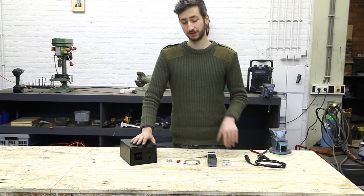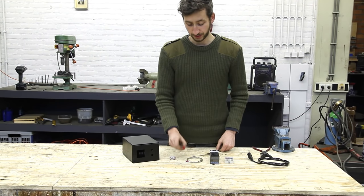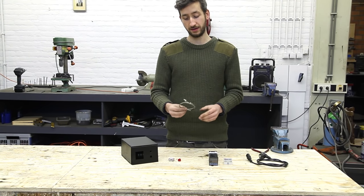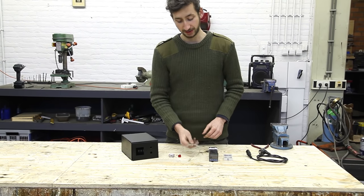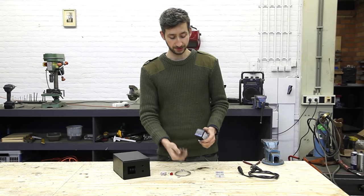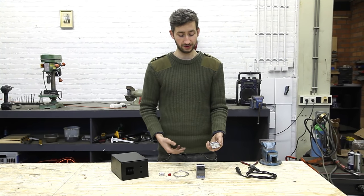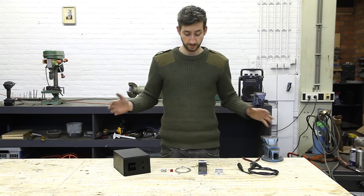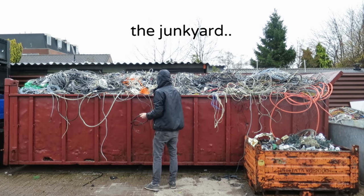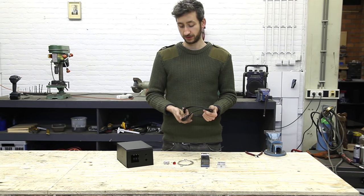We finished the metal box. Now we're going to install all the electronics: a switch to turn on the electricity which makes a light go on so we can see it's on; a thermocouple in the oven to measure the temperature inside, which feeds into a controller where we can set the temperature; and a solid state relay which will then heat the oven. We're going to wire it up with cables — this cable is from an old printer and we'll use it for the main power supply.